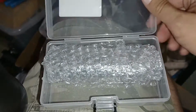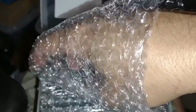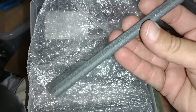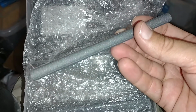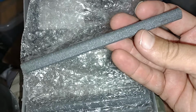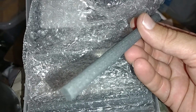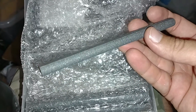Okay, so in order to make an impulse transformer, we need the transformer. This is going to be different than a Tesla coil. A Tesla coil requires narrow resonance. You have to basically resonate it at its resonant frequency for a while for it to build up the energy. And Tesla coils cannot handle different types of impedances. If the impedance is not proper, so it can't build up a resonance, it will never build up high voltage. But a pulse transformer can, especially if you have a magnetic core.